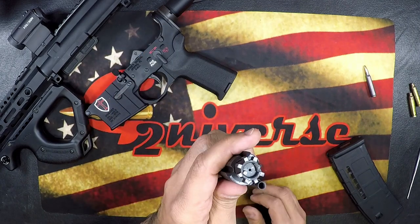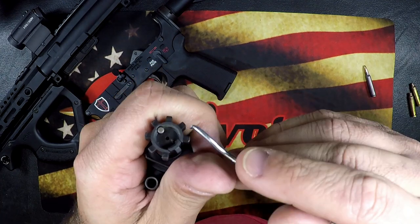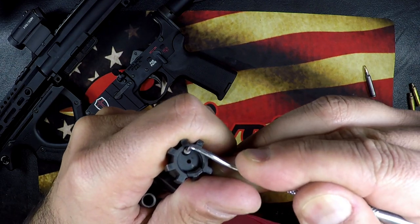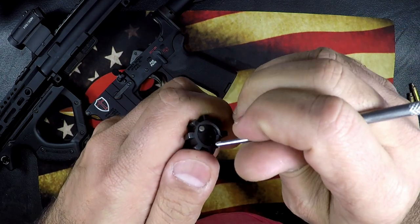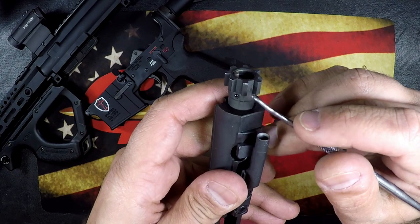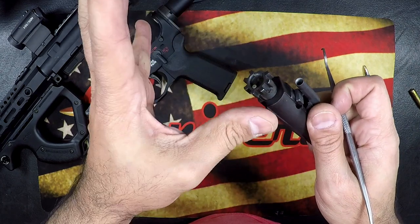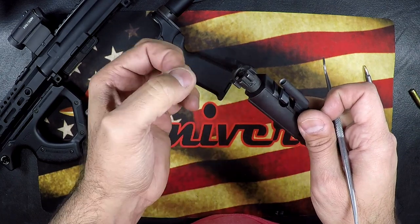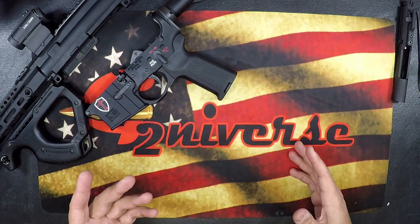Your ejector is located on the face of your bolt — this little spring and plunger is under a tremendous amount of pressure. It should not move easily — you should not be able to move it with your hand. Take the ejector out — remember it's under a lot of pressure, so when you're punching out the little roll pin, make sure to have it upside down or your finger in front of it, or you'll lose the whole thing. Inspect the spring and the plunger, make sure everything is moving freely, give it a little bit of grease if needed, and retry. That should solve your failure to eject issue.